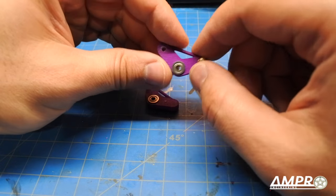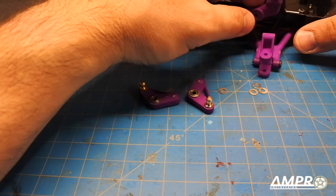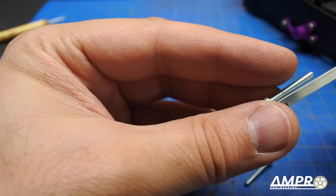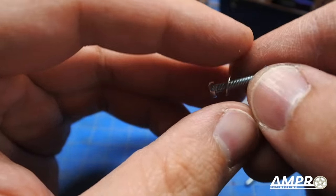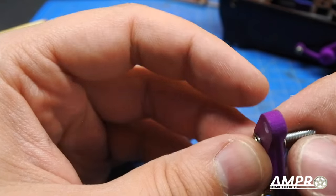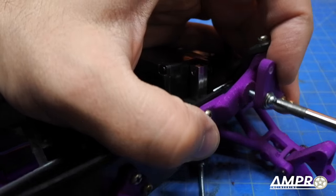This thing is going to pivot on that brass sleeve. The brass sleeve is going to be held in place or sandwiched between these washers here. For this I'm definitely going to use a machine screw to go through the cantilever arm into the central pivot hole here and then a nut on the back side of it. This is the M3 screw we're going to use and this one is 20 millimeters long. We're going to take the M3, put a washer on — this is a metric washer and it's actually important to use a metric washer so that it properly seats against that brass sleeve — then the cantilever arm, then another brass sleeve and another washer like so. Then we shove it in here. Usually I talk about having to drill these out and the reason I haven't done it here is any extra bite in these isn't a bad thing — I really want this to be a super tight fit.